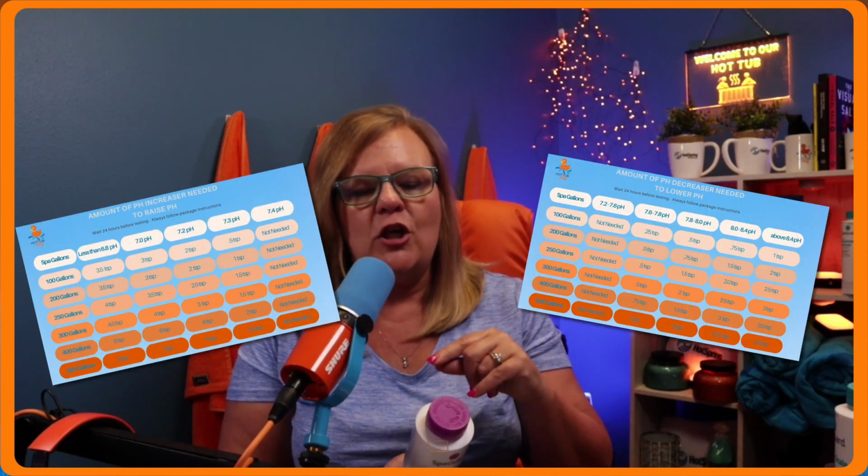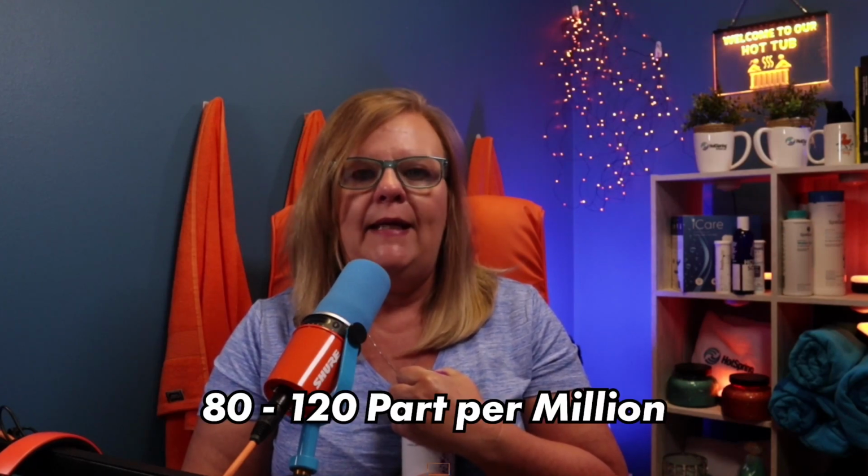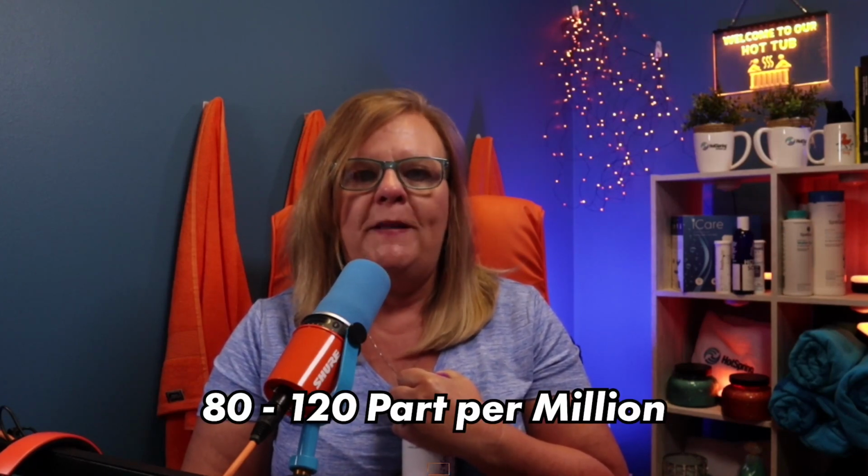You do want to adjust accordingly, but make sure you check out these charts so you know what's going on and you do things correctly and put in the right dosages. But just to recap what we've talked about so far, you want your alkalinity to be between 80 and 120, and you want your pH to be at 7.6. So that takes care of all that.